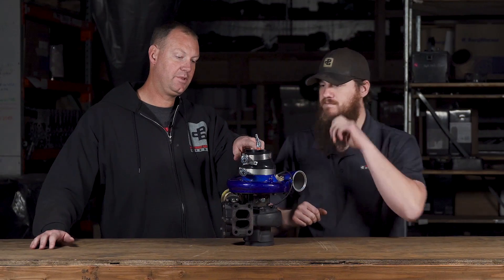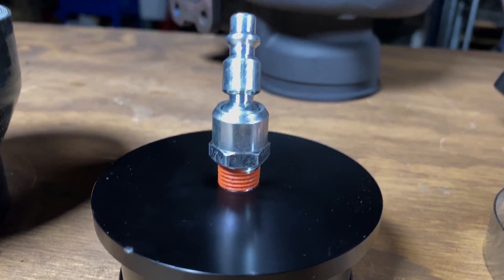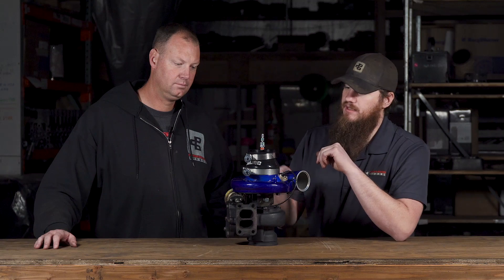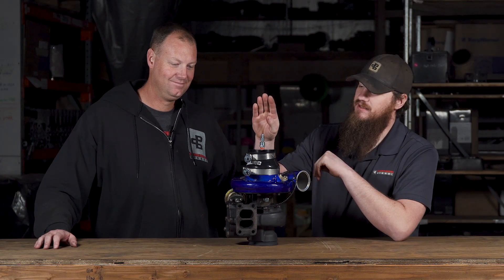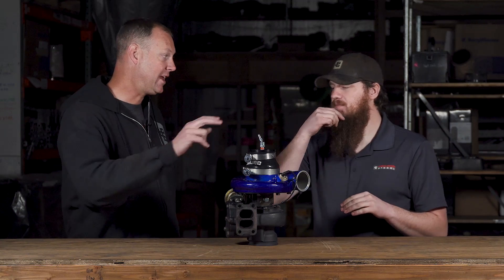This fitting comes with a compound already on it — there's pre-applied thread sealant here, so you don't need to worry about that. Then you tighten these down into a low orbit — that means tighten them up real good. Then connect regulated — and I want to stress regulated — shop air into this, because this can be a nice little cannon.